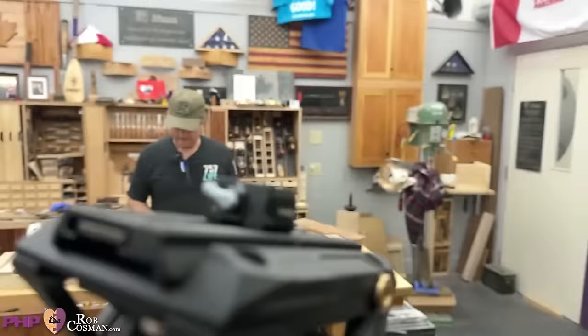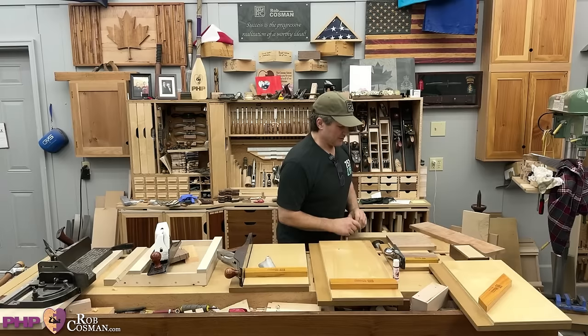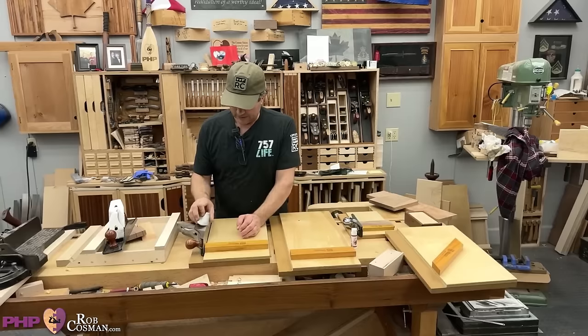This one comes from Jerry Thompson in Newport Beach, California. Hey, Jerry. How far can I stretch the uses of a block plane shooting board? Well, the only limitation on a block plane is its size. Ideally, you want length and weight. Why do you want weight? Well, you're cutting through end grain, which is a hard cut.